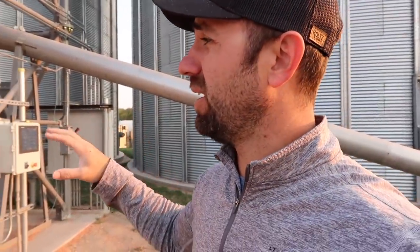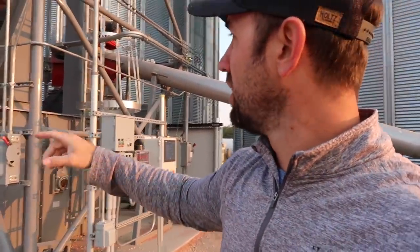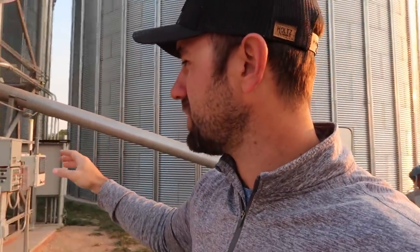A lot of it's in that 18 to 19% range, so we're not doing really wet corn right now. The reason is we didn't want a bunch of super wet corn because you could get in a mess in a big hurry. It sucks corn out of the wet bin, goes up the wet leg, and dumps it down into this dryer. If we want to dump at the same time with our pits, whatever can't get into the dryer will just spill over into the wet bin so you're not overfilling anything. You can hear those motors kick on right now — it's asking for grain to go up that leg and fill the dryer.